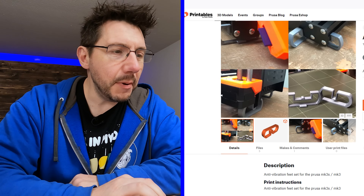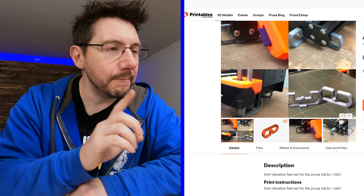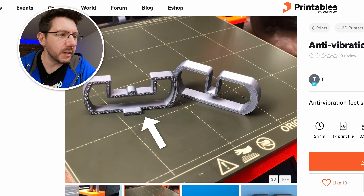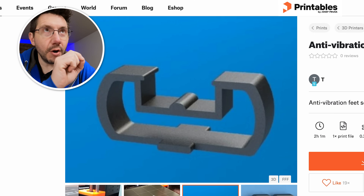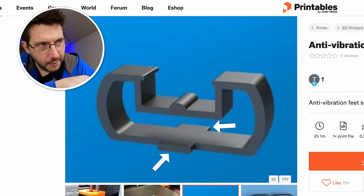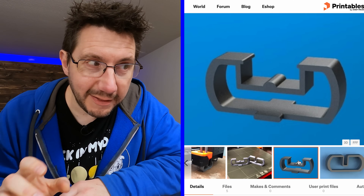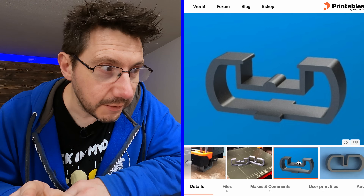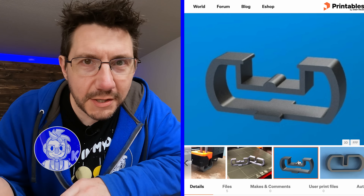Here's a picture of how it works — it kind of clips across the extrusion or the metal bracket at the front, and that works great. But I did notice something. Looking at that model on the left, it looks like it was printed with supports, and I think that little foot at the bottom is the culprit. This could be so much easier to print if those two little feet on this foot weren't there. I don't think those little pushouts at the bottom are needed for stability, and I think these are gonna work as-is without those. Rather than fire up a CAD program to do some editing, we can just do this in the slicer.